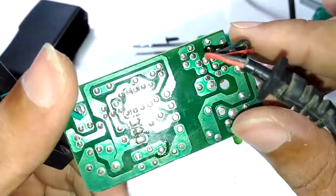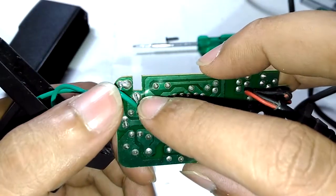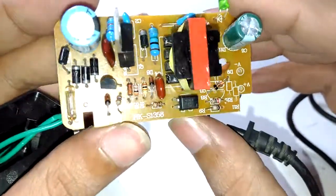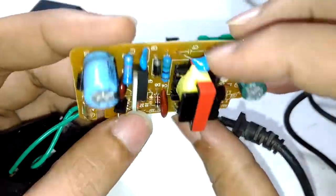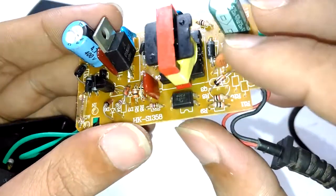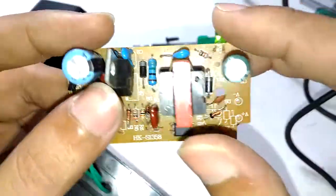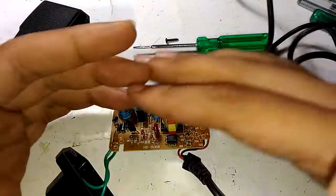The soldering job is fairly good overall, though at one point it's not properly done and could tear off — that's the issue with cold solder joints; you need to add some flux to get a good result. It does have a proper suppression capacitor across the right points. Overall, it's a fairly good enough power supply. Anyway, thanks for watching — see you in another video.